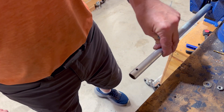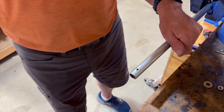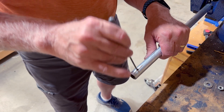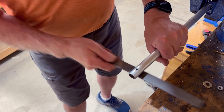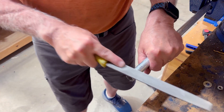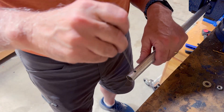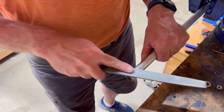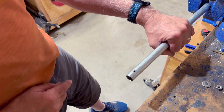For each one of my holes I have to file — there's always a little burr. I get a flat file and file it, then take a small round one and make sure I get rid of all those burrs. I do the same thing on the back side, which actually has the roughest edge. Now it's nice and clean and will easily slide in my 3D-printed parts.